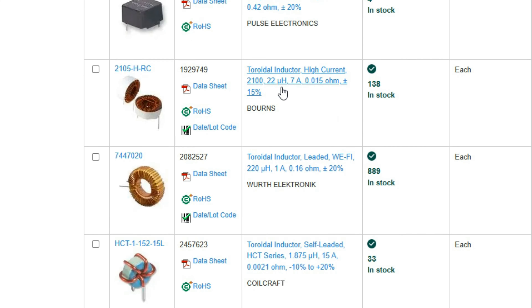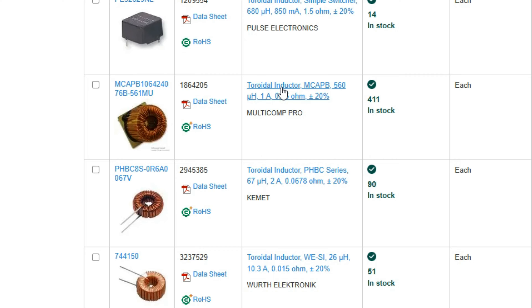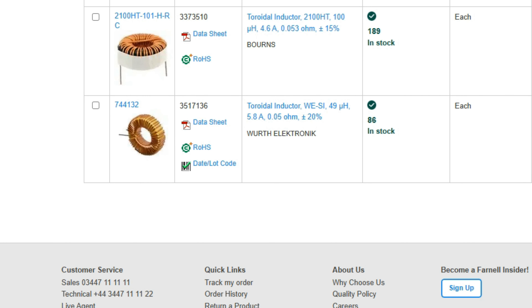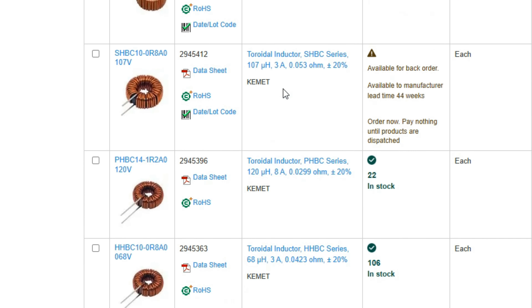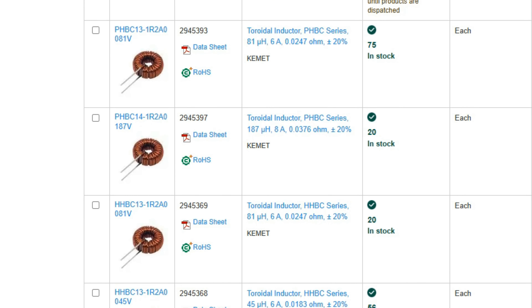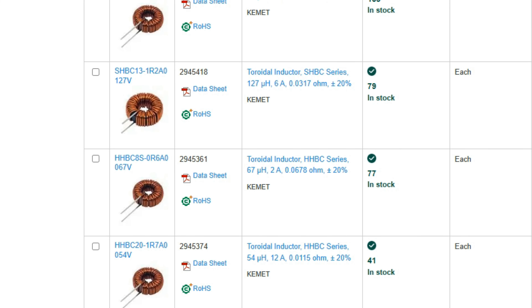The other thing is the physical size of coils. Because of the way they're constructed they are very often heavy, and that means when they're soldered into boards you must do the appropriate lead bending when you solder one in. Otherwise if you just put the lead straight through and solder it, it will at some point fall out under its own weight. If it's on top of the board it will push itself down and possibly lift the tracks, and if it's underneath the board it'll pull itself out and drop. I've seen that many times.